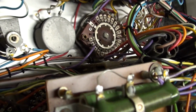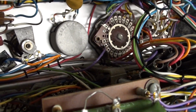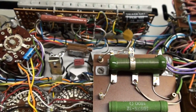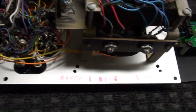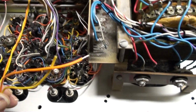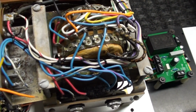But these wires, once you take them out of that bundle of wires, I cut that one loop off. It's hard for me to see on the camera if I'm even getting this. But I just cut one loop right before it starts turning, and I pulled these wires through with a pair of small pliers. I just pulled them right through. Very easy to do. I had no problems doing it. Some may be tougher than others, but no matter what, you're going to have to extend. If you don't do what I did, pull these through, you're going to have to extend the length of the wires just a couple inches, maybe 3 or 4 inches, so you can reach the top of the meter, because that's where the signal in is at.